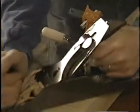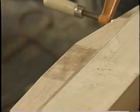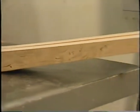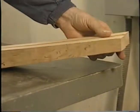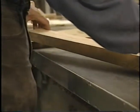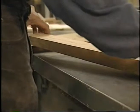The back end of the plane rides on the block while the blade flattens and squares up the facet where the side rail will join the leg. Once you've planed a pair of legs, check to be sure those side rail flats line up. This is essential for a square back assembly. The lower legs are a bit off. That's okay. The uppers, where all of the joints will be, line up perfectly, as they have to.